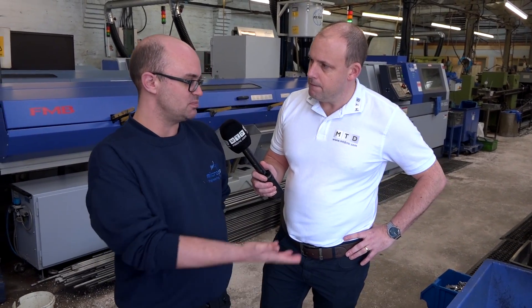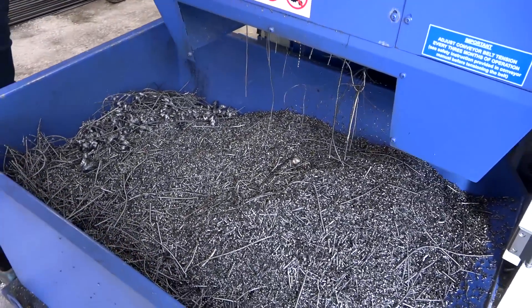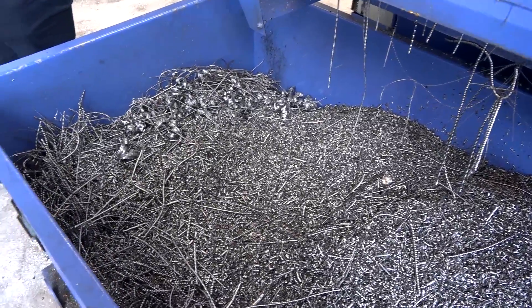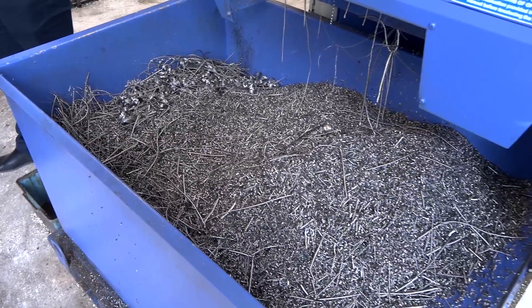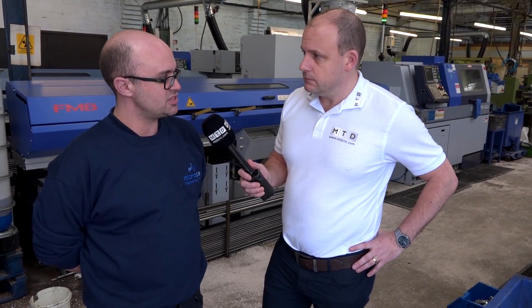The stringy swarf is purely part-off swarf — I'm still running a high-pressure hose through the part-off, so I don't really need to use HFT on that as I'm getting the swarf off manageably. The finer swarf is Z-axis turning. Can you use HFT on every axis? Yes, I'm currently using it on head one on this machine, head one on the 20mm over there, and head two on the 32J. Before you were using it here, were you having problems with swarf? Yes, it was quite bad, especially on the Z-axis turning.